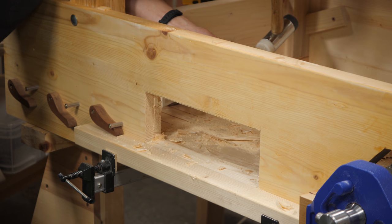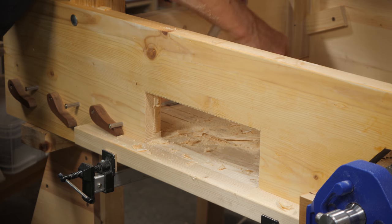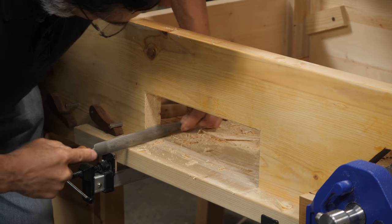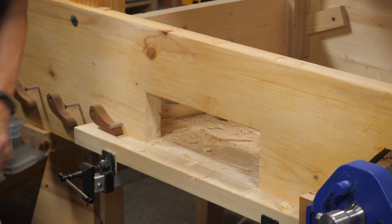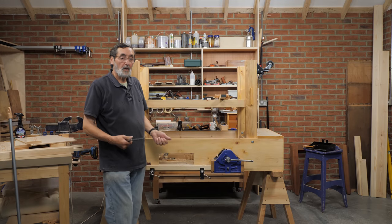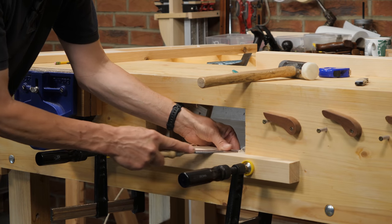You're about halfway. I can get with a rasp. If you don't have a rasp, you'll have to go with your chisel. And that's how that's done. This bottom edge I'm going to do when I flip the bench over and I'm ready to run my runners, set out for that, because I'll find it easier to go from the top pressing down rather than trying to push from the underside. I've just pared up the sides and the top, and I'm just paring up the bottom